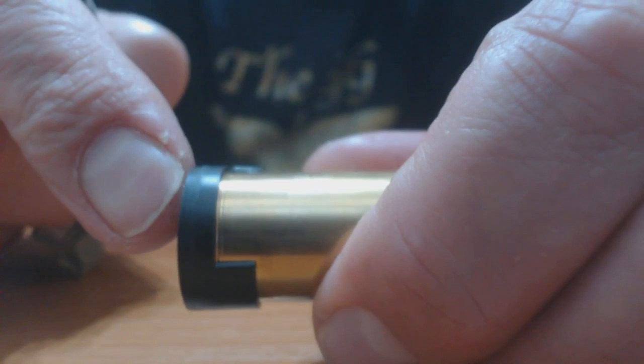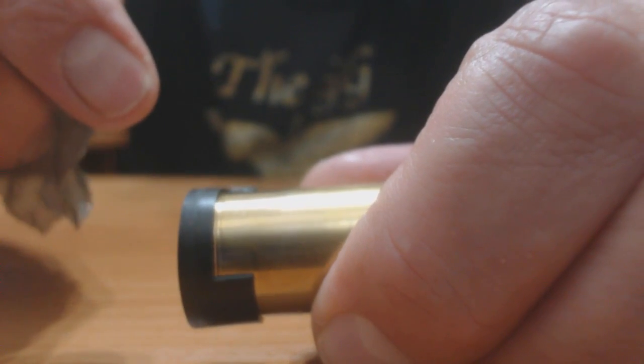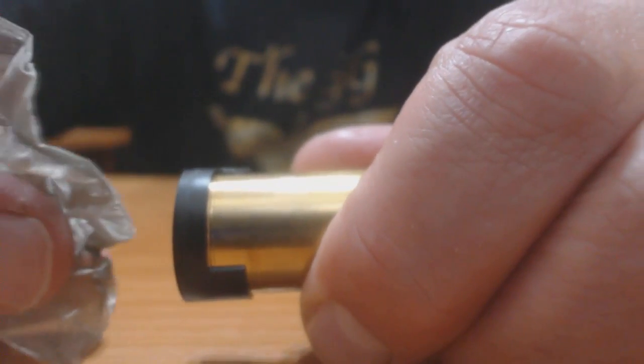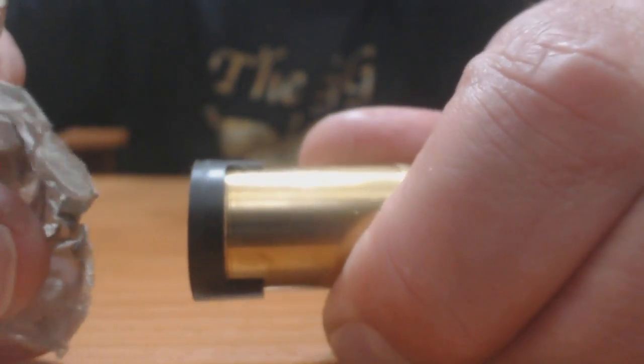That's why I told you this plastic will never be removed — only if it gets damaged, which is something impossible. Now it is going okay, very easy. We screw it very hard so it will always be in place. And that's it. Now let's clean this piece of brass with polish. Don't use sandpaper, even a thin one, because you will eat the metal. Polish does a very good job — it doesn't eat the metal and it shines it very well.